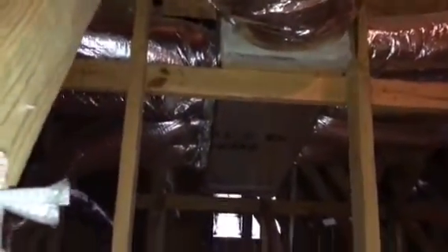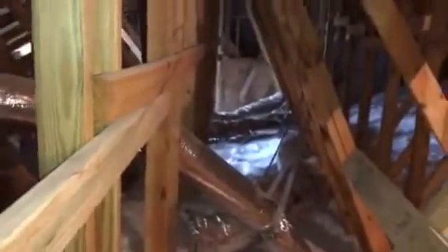Look at some of this ductwork. Here's that one 10-inch duct — or is that a 12? — comes off here and goes over to that crazy-looking distribution box. I guess you could call it a duct board rectangle — more like a high school shop experiment. You can see this flex duct just going everywhere in a mess, barely fits in the pan. And that one larger duct up there goes to probably another one of those distribution boxes over there.